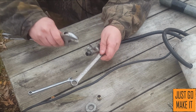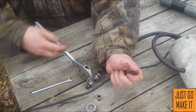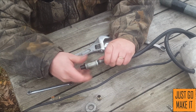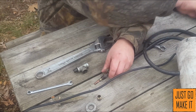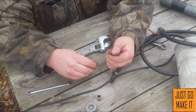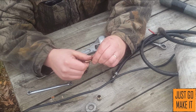And then inside of that is another fitting. This is actually just one of these air hose couplers. That's all I had on hand at the time, and I took it and drilled and threaded the inside of it to where this jet of some sort that came out of the motorcycle carburetor that I had would fit, and then I drilled the end of it and tapped it to 1/4 inch threads for a MIG welder tip.